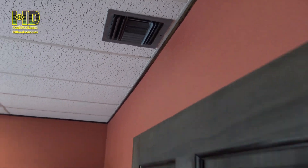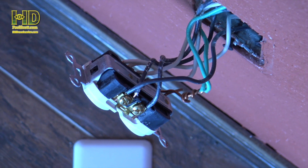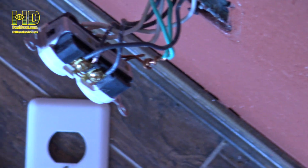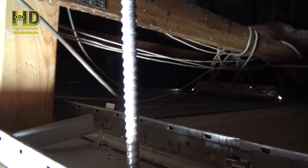This is what the waiting room looks like now, so let's see what happens. Once you come out - so the first thing, there was supposed to be a wire nut there. You're supposed to strap that cable. The bottom - you need a wire nut on that. You're supposed to strap it on that wood and go down to where the junction box is, and it's not strapped.